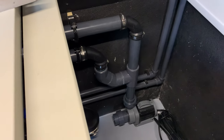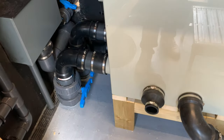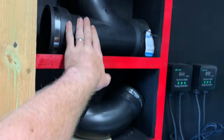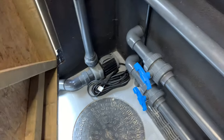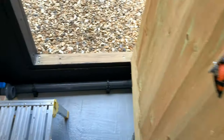I'm having a bit of a job working it all out — I don't like pipe work, but it's a job that's got to be done. The next bit I'm going to run off rubber boots so I can decide exactly how I'm going to get that line to feed two pumps later. I'll probably run it off a four inch, then split the four inch and run two four inch lines reducing down to two inch with two separate pumps. But at the moment I've only got the one pump, so I could take that pump down there and put my old pump on it — that's crossing my mind.